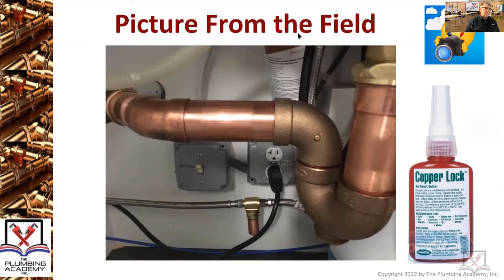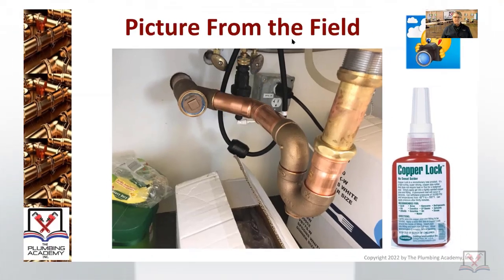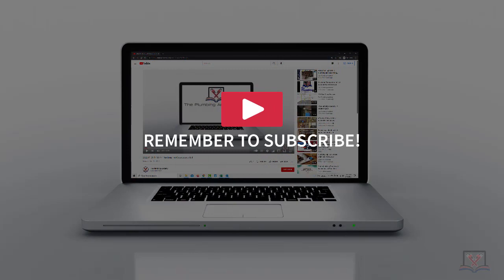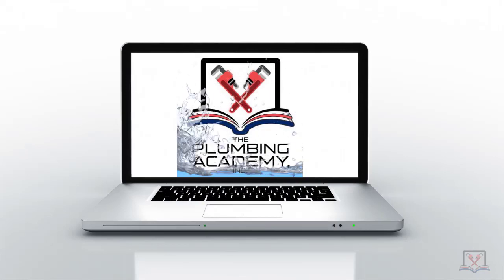Copper lock — trying to get away from soldering. Can't use white metal jam nuts; anything you're using has to be brass. There's a lot of good stuff shown there: a water hammer arrestor in the back for the dishwasher, a cleanout, a water safety shutoff valve for a water treatment device. That black device you see behind the copper automatically shuts off the water simply by the rate of flow.